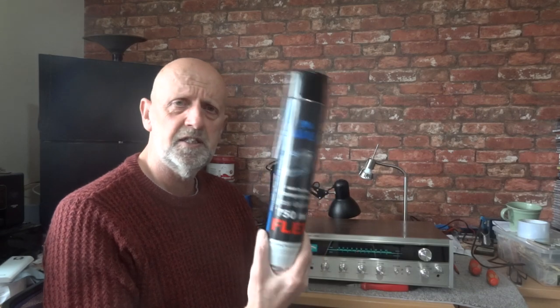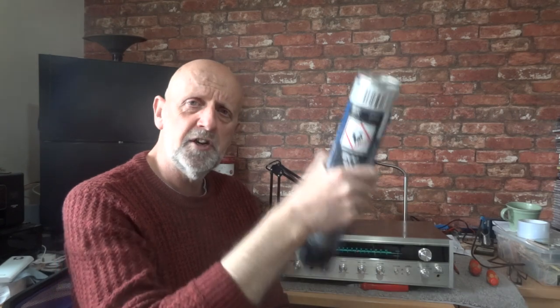I'm going to show you a couple of pictures and a sound test of what's happening. This was done live with the unit on, using this coolant spray — it's a coolant as well as a duster. You can get them in smaller sizes. If you turn it upside down and spray, it flows out as very cold air to freeze components. This is a method for someone with hardly anything in their toolbox who wants to find out which part has gone wrong. I suspect it's a leaky transistor on the left channel.